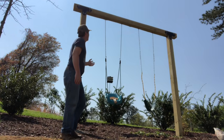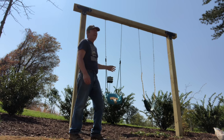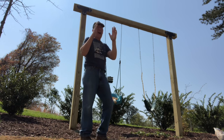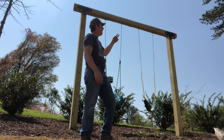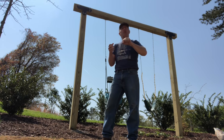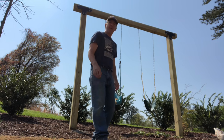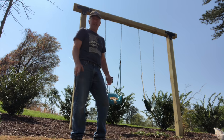There you have it — there's our finished product. Two people helped me lift up the beam. We had a ladder on each post, and once we got it off the temporary support it was a little bit heavy — that's the most dangerous spot. You just lift it up into position with the brackets as a guide to set down on the post. Once you get it in position the weight is stable, then you put the bolts through. One end fit fine — the other end we had to adjust a little bit using a nail punch to guide the bolts through, since it's a lot of distance to get it exactly right the first time. I hope you enjoy it — hit like on the YouTube page and enjoy many years with the kids and grandkids!